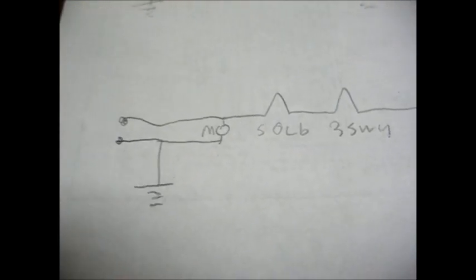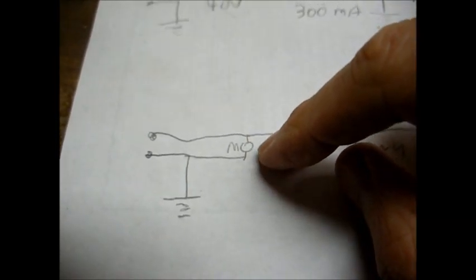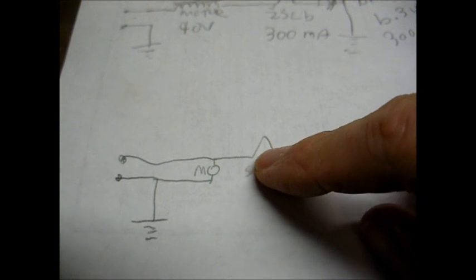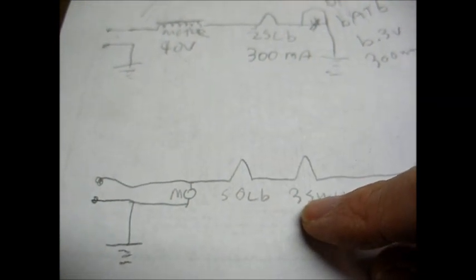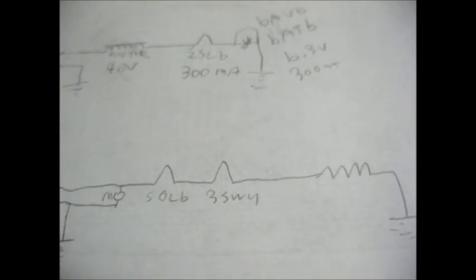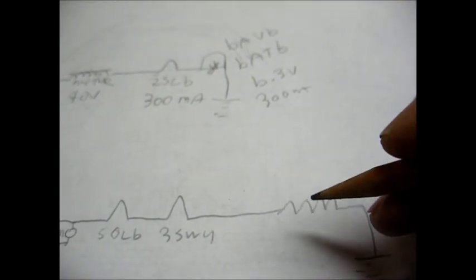In the second type of circuit you'll run into, we have our 120 volts coming in. This design uses a standard 120-volt AC motor wired across the line. We then have a 50L6 output tube in series with a 35W4 rectifier. The total of that is 85 volts, which is a good bit away from the 120-volt line input. The way we get around that is with a big dropping resistor — something probably along the lines of 150 ohm, 10 watt.